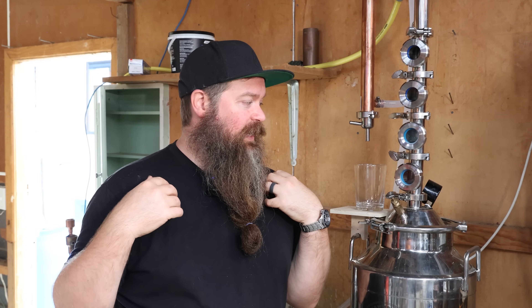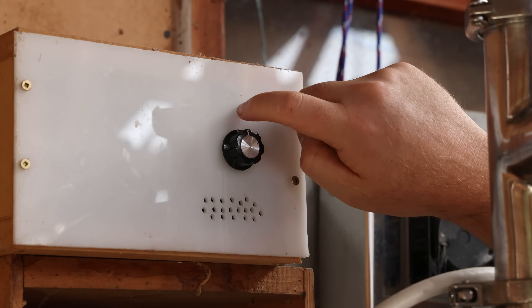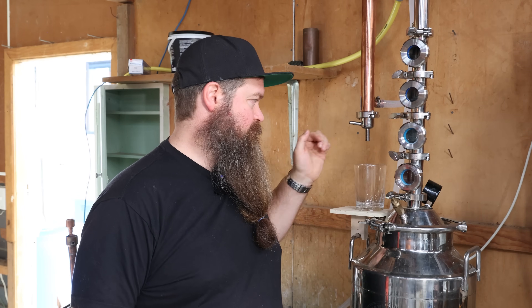The way that I'm going to balance this still today is essentially to use the power knob to make sure the plates stay balanced, and then use the tap outside with tiny little micro adjustments to change the water flow and adjust the offtake speed. I'd like to keep water as the offtake speed control and power as the plate-balancing control.